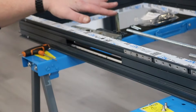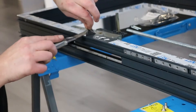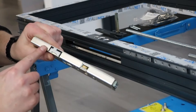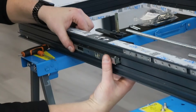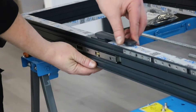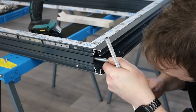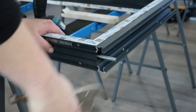We can now put the gearbox together. Start by removing any tape from behind the handle so we don't trap it. Place the gearbox in — there are holes on one side, so the side with no holes faces inwards while the side with holes faces outwards. Feed the handle through and screw into position. We now need to put the M10 threaded rod into the hole, line it up with the gearbox, screw into the gearbox, nip it up tight with grips, and repeat on the other side.